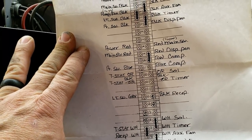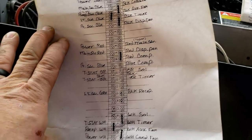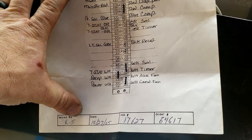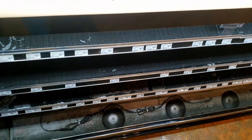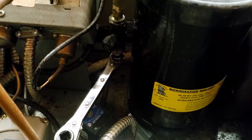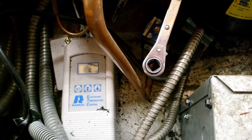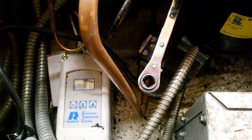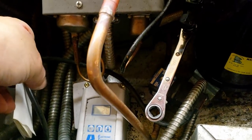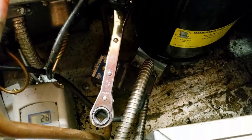It doesn't tell me how it's wired or whether they'd normally shut off the condenser fans, which would make sense. We're not up to 65 PSI pressure yet, so it's not coming on obviously. This thing has some issues — looks like timed-off defrost. Probably going to need to grab the pump sprayer and some hot water to melt that coil out. Once we get pressure up and it's running, I'll valve off the receiver to see if it pumps down normally, and find out whether the temperature sensor is acting wacky. I highly doubt it could have gotten to negative 7, which really makes me think we've got solenoid leak-by going on.